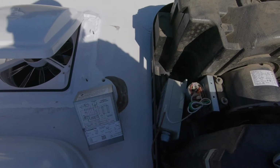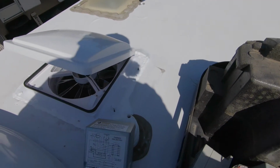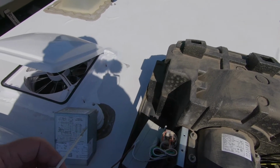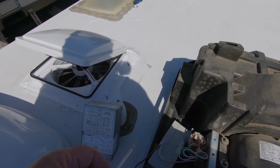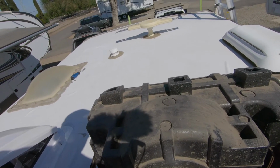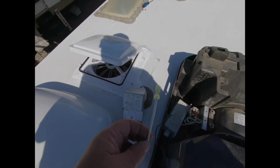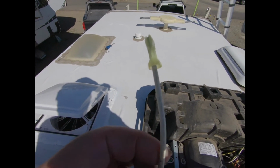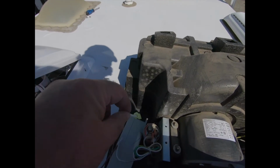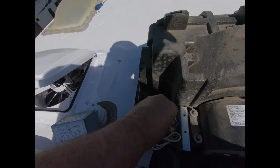The next wire that gets connected from the Easy Start will be this white wire. And this white wire gets a female quick connect and it gets put on the place basically where the other white wire was just taken off. So the white wire from the Easy Start now has a yellow quick connect on it, female quick connect. It's going to go to the white where this other white wire was just taken off, and that's a common on our capacitor. So it just gets plugged in basically.